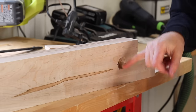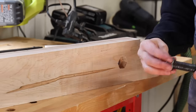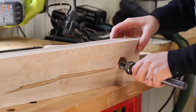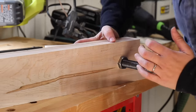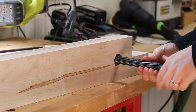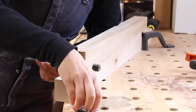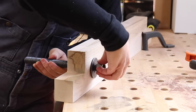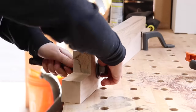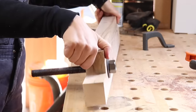The holes that I made to fit the nuts in the back jaw go on the inside face. I'll just thread this on a little bit and set it into place. Now I'll keep screwing it until it comes out through the back, then lock it into place with a washer and another nut. I'll repeat the same thing on the other side.